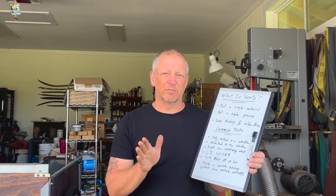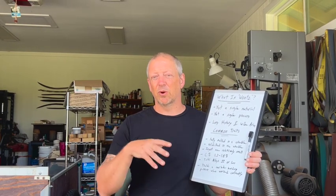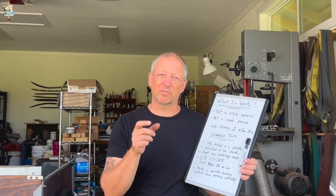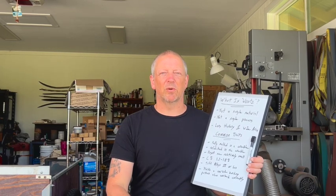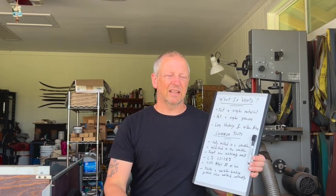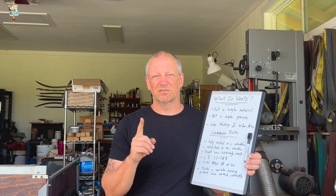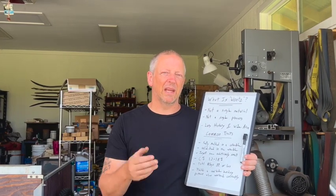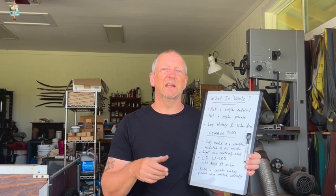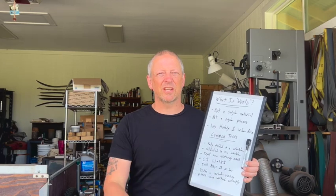And again, I'm referring to historical ingot size. There were some processes that made ingots up to twice that big, and there were some processes that made even smaller ingots. But as a general rule, when we're talking about Wootz, that's the size to be thinking of. And a key aspect of that is that that's a size of ingot that one person can handle. That is, the smaller ones could be forged out by hand by a single person. The larger ones could be manipulated by one person and forged by a team of strikers. And those are the sizes we're talking about.